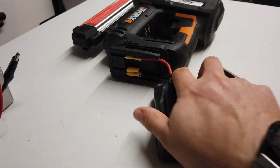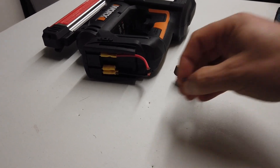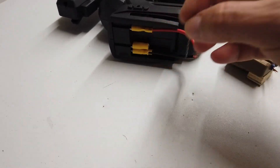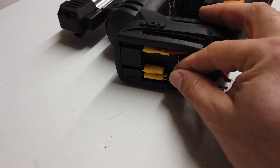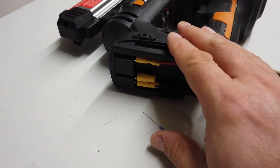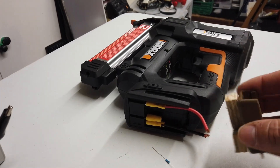The good news is it's not that complicated. You can fool this entire system with a little 10K resistor. If I plug this 10K resistor between this pin - the ground here - and this thermal sense pin here, then this gun functions as per normal. So I'm going to go ahead and make that modification.